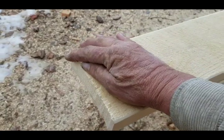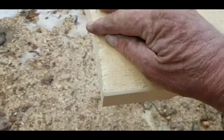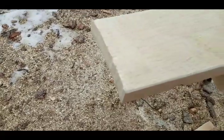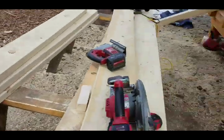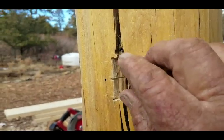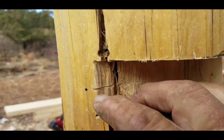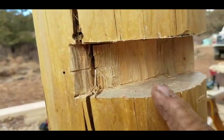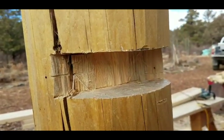When I do this cut that fits into the mortise in the post, I like to dish it out a little bit so that maybe this is three sixteenths of an inch deeper in the ends. That way these points here are making contact with the mortise right here, so it's a real tight fit. Now I'm going to clean that up a little bit. This already fits real good, so when I pull my timber locks up underneath here and bolt it in, it'll be real rock solid.